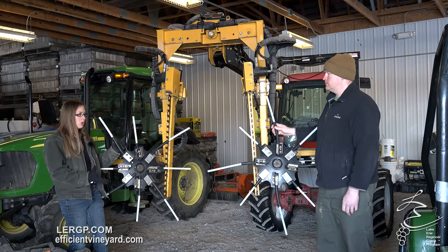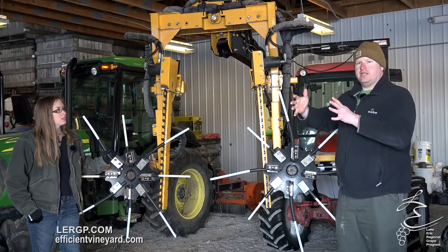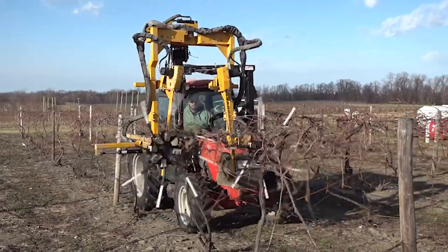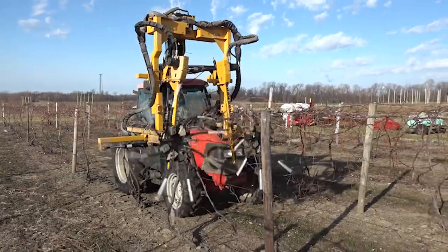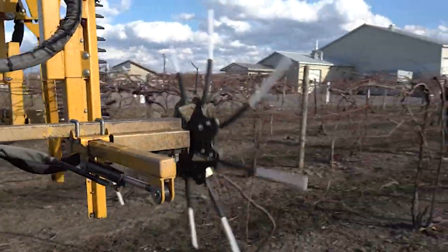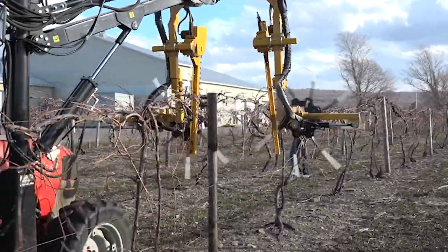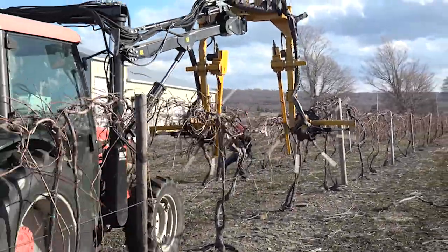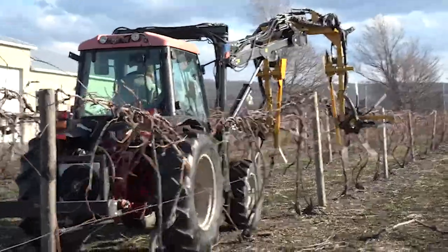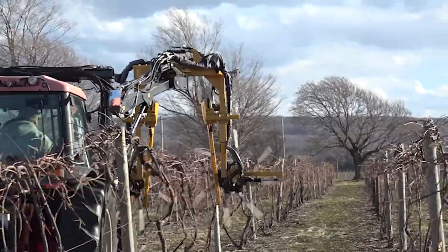So what's the advantage to having a combing type system versus leaving a box? With just your box, pretty much what is there in the sickle bar is going to get cut — nothing will get pulled out. Having the comber gives you the ability to comb through and pull out undergrowth from the bottom. You can peel off the top if you need to, and it takes your canes that would be tangled up and pulls them out and draws them into the cutter so you can cut them off to length. It just makes a more manageable vine to come back through and hand prune after the fact, opening up that canopy and mimicking more of a hand pruning situation.